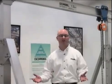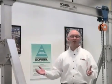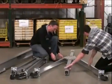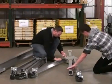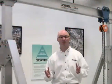The concept for the aluminum gantry crane is very simple. It needs to be able to be moved to a specific location — hence the reason we use aluminum — to keep it light. We use channel on our legs instead of full tube, and we use a design that is collapsible. You can actually collapse the legs themselves to be able to fit into small places.